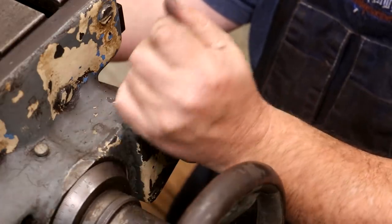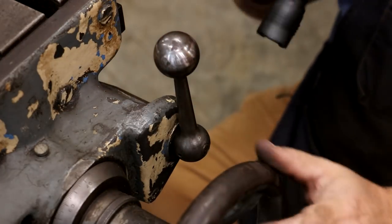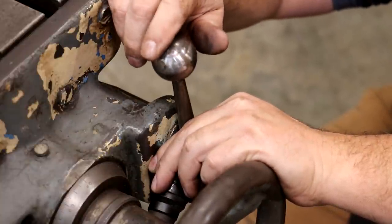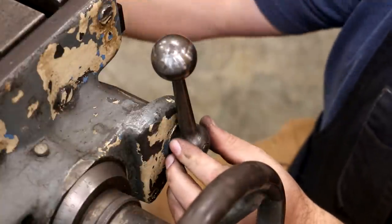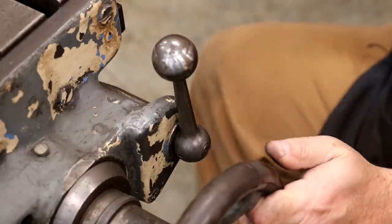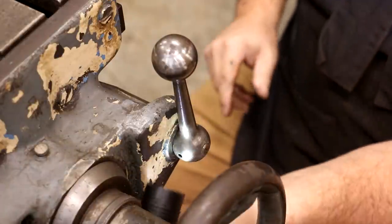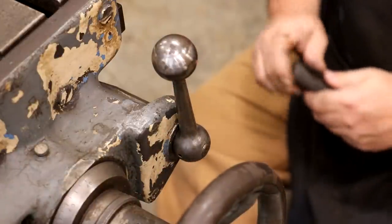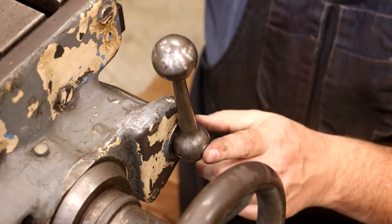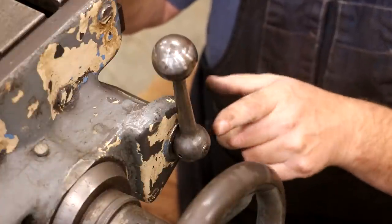I'm kind of pulling this shaft out a little bit to get it all the way up on there — that last little bit is giving me a little bit of trouble. Let me see what my hole looks like. I see light through there and it looks like it needs to bump up on there just a touch farther. So I'm going to go grab my lead hammer or maybe one of my brass hammers and knock that on there a little bit farther. That went right up on there. I can see through that hole and I'm kind of amazed — I think it's going to line up. I'm going to get a tapered reamer and just go ahead and ream it fresh to make sure I've got a perfect match, but it's really close right now.